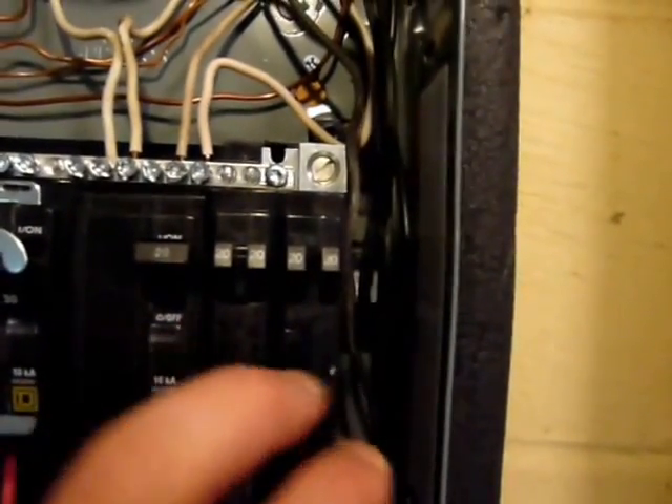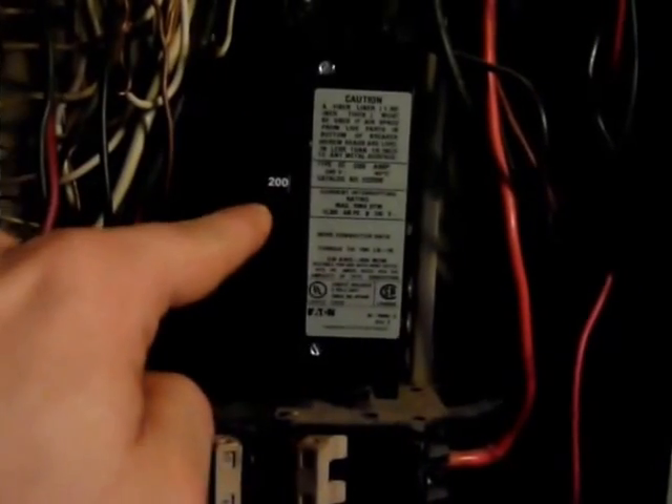The circuits you see here — water pump, internet, freezer, fridge — were originally attached over here where these white things are, just so I knew which ones to pull when the power was out. Before removing these circuits, I'd recommend pulling this down to turn off all the house power so it's safer to remove wires.